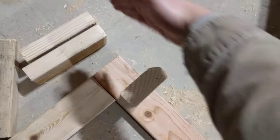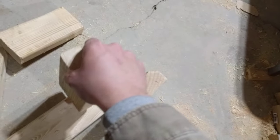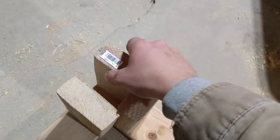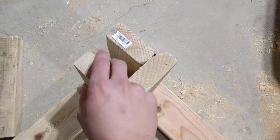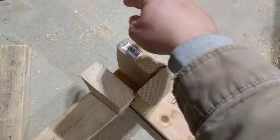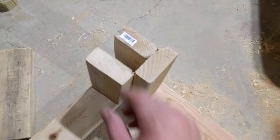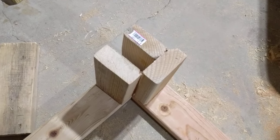Right here, and then obviously on this side and this side. You could make a corner like this. There's actually a lot of different ways you can do this, but this is one of the ways you can make it. And this gives you an anchor point here and here, and then also your outside corner here. The negative to this is if you were to try to insulate this wall, you would have kind of difficulty getting this little cavity insulated, and it wouldn't be very effective.